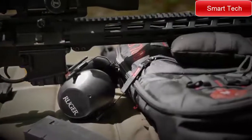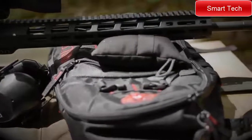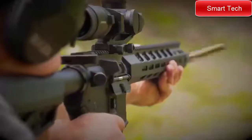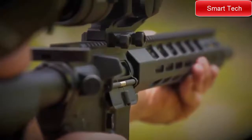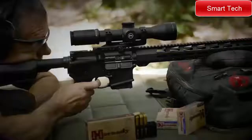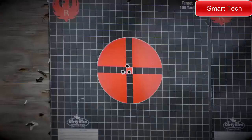The heart of the AR-556 build is its barrel. Cold hammer forged from chrome moly steel, it's forged with minimum bore and groove dimensions and 5R rifling. 5R rifling distorts bullet jackets less, fouls more slowly, cleans more easily. This barrel is forged with a 1/8 twist that will stabilize just about any bullet length, and the 18-inch length gives a little extra velocity boost over the standard 16-inch tube.